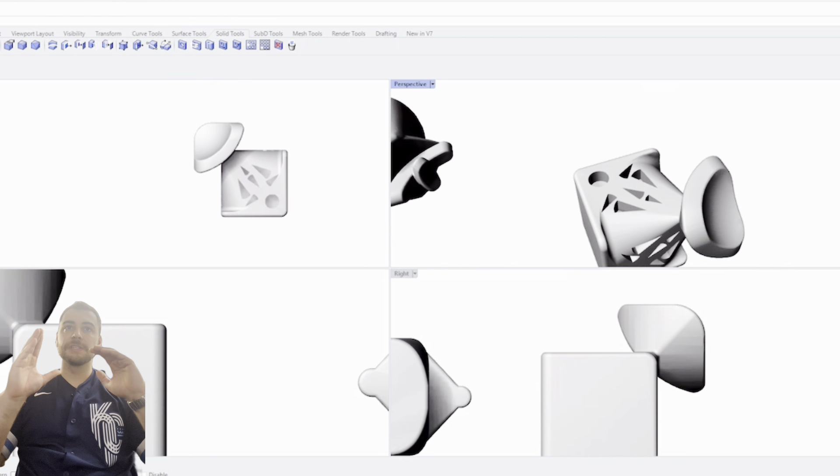The next step is putting all of these in one platform to 3D print through Creality. Now that the software is open, we have our 3D print bed. We can open projects, quick select, and we have our pieces ready to 3D print. I want to make sure these pieces are really accurate, so I'm going to decrease the layer height to 0.1 millimeter. It'll do a lot more printing but less filament per layer, meaning our pieces will be a lot more accurate.